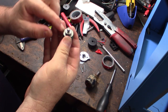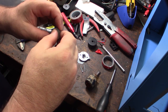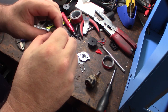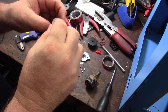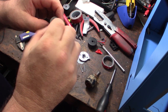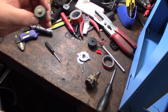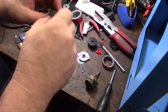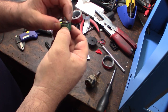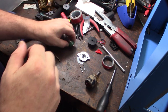I don't know if that's what you'd see on a typical NEMA 17 motor. To buy a new bearing I'd have to look at the model number — it's so tiny I'd probably need my microscope. Even just half a millimeter of bad clearance could make this thing rub because it's super tight on there. The front one feels good, the back one's bad. I'm going to go through my NEMA 17 box.